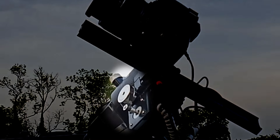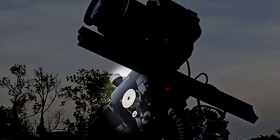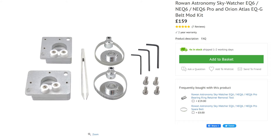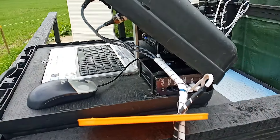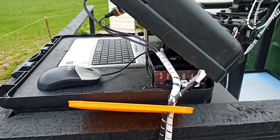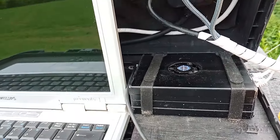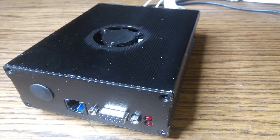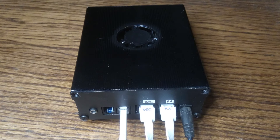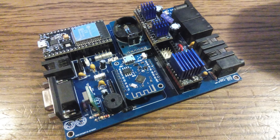It doesn't look as pretty, but I believe it to be a better solution because it has stronger, more accurate motors — these are 0.9 degree, 400 step motors. In most of the other kits, there are only 200 steps per rotation. And accuracy with a 1000mm focal length makes a big difference. All those other kits are also gear driven, which allows for backlash — when the gears start, stop, or change direction, there's a little bit of play, and that little bit of play over a 1000mm focal length makes a big difference. So this is belt driven, and that is a popular modification for much of Skywatcher's gear — what they call the Rowan belt mod. Even the big expensive mounts like the EQ6 benefit from this upgrade.